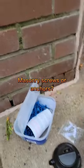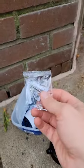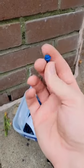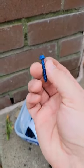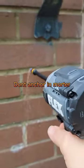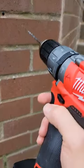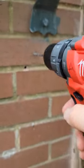I'm putting this light up in some brick, and a lot of the packaging will come with these cheap plastic anchors. You actually don't even need anchors. You can use these concrete screws — branded sometimes as Tapcon, though different brands make them now — and all you have to do is take the included drill bit and drill a hole.